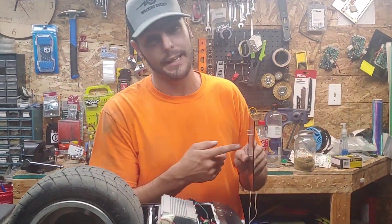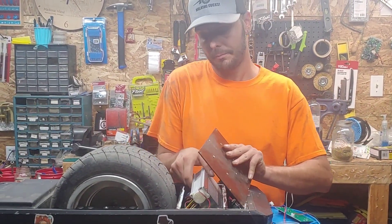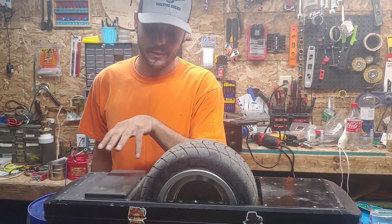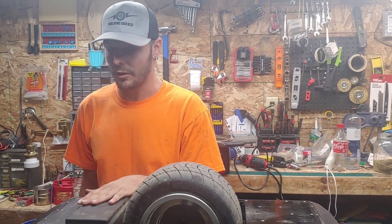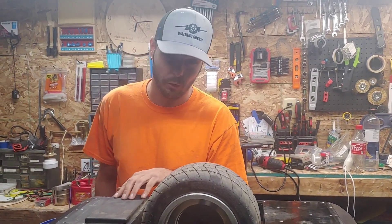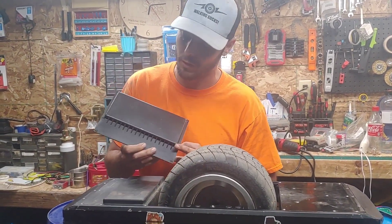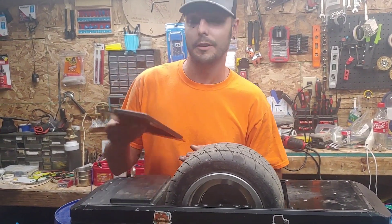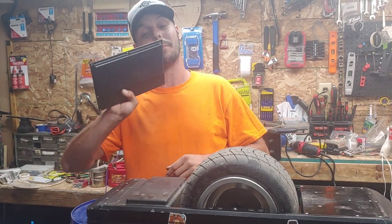These ones are a lot easier to attach back to the plate — they've just got four threaded holes on the bottom, line it up and screw them in. In addition to the new motherboard and controller, these original Maxes also have this prototype plastic bottom plate. Honestly, these things are super flimsy; I've had multiple crack on me. I fought tooth and nail to get these new aluminum composite ones, which are super sturdy — I beat on one with a hammer. They're non-conductive, super lightweight, and amazing protection for the battery. Such an upgrade.